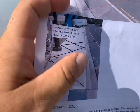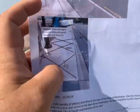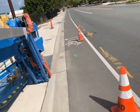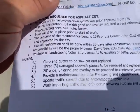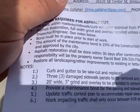In this drawing here, you've got those three panels and also the curb and gutter that ramps down — we'd have to take that out too. The scope says: remove three damaged concrete sidewalk panels, saw cut curb line. On the opposite side it says curb and gutter to be saw cut and replaced, the three damaged sidewalk panels to be removed and replaced, and a 20-foot wide three-inch grinding overlay to be provided to the centerline crown of the roadway.